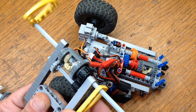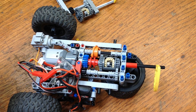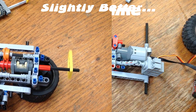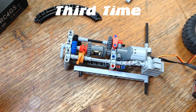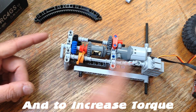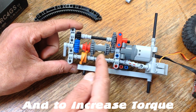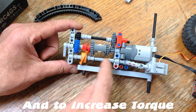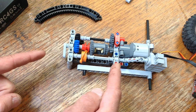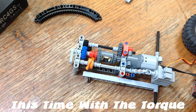This will probably necessitate gearing down after the transmission. Actually, I don't like that idea either — the whole point of this transmission is to have a large gear ratio change between high gear and low gear. So what I did here is basically flip the whole thing around, added this little eight-tooth gear, and now we're going to have about a 5-to-1 on the outside and a 1-to-1 straight through.